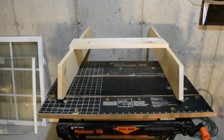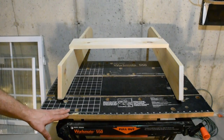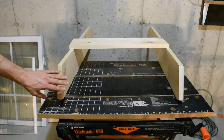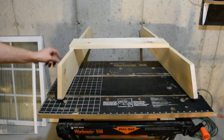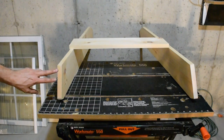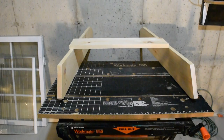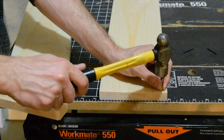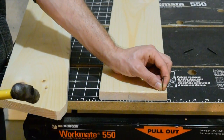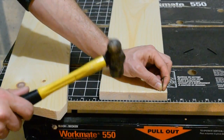I don't have a very elaborate workbench setup for woodworking. So I've got my workmate bench up against the wall and the two seat braces pushed against the wall so I can use it to hold the boards while I nail this one in place. A power nailer would be ideal, but I don't have one, so I'll nail by hand with a regular hammer. I'll pre-start these nails first so that just the tips are sticking out, so when I put them on the seat braces they'll stick a little bit and help keep them from moving while I nail them into place.